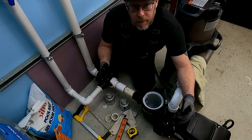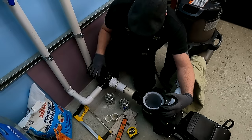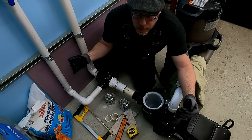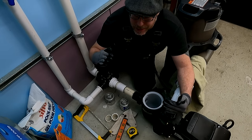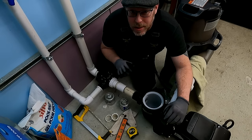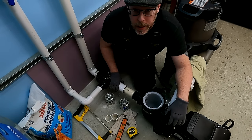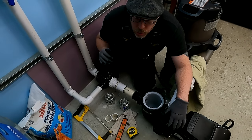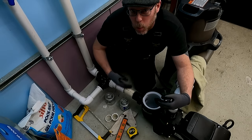Along that line of tolerance — one eighth of an inch — you're going to have pipes coming around that have to meet together at the pump, and you want it all sitting naturally and not under strain. You don't want to have to bend the pipe to get it to line up so you can get the union closed. That's not a good long-term plan. You're probably going to end up with a leak. Worst case, you could end up with a break causing a flood or equipment damage.